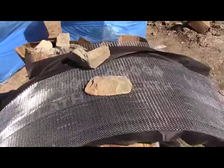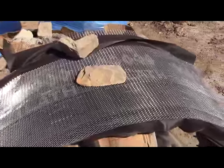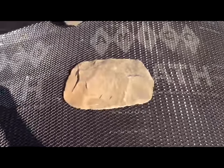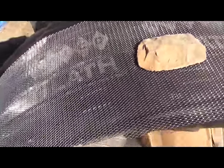On our stone video, to give you an idea — they nail up this mesh here, and you can see it's got some felt behind it. They nail that wherever your stone is going, then they take concrete, concrete the back of the stone, and put them together so everything gets concreted up. They staple this all over.